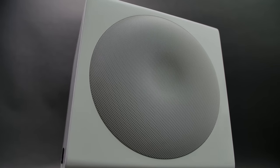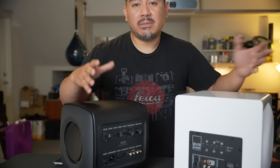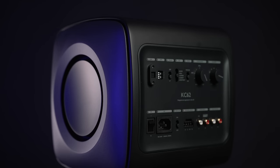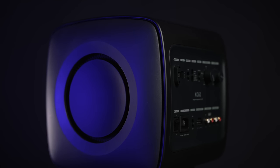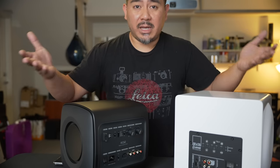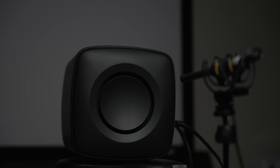But if you're setting up a small home theater or you have an AVR, I'd recommend the SVS — at half the price, you can get two of these to one KEF and put them on opposite sides of the room for more and more even bass. Also be careful if you want to use the KEF for movies: the dynamic EQ makes it tough to use external room EQ like Audyssey, because the frequency response changes with volume during calibration.